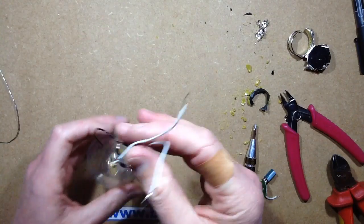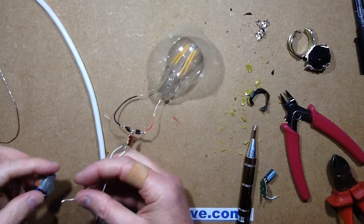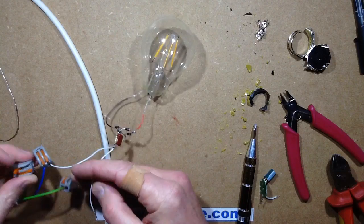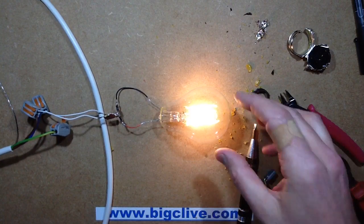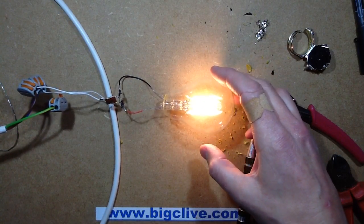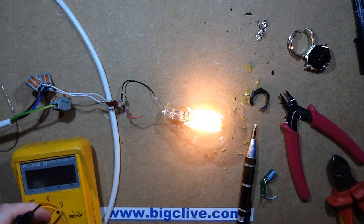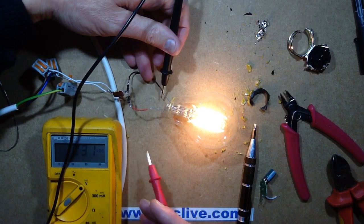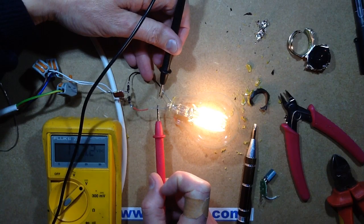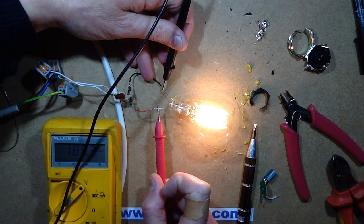Shall we try this? One connection. Do a connection. Yay! Did it flicker initially? It is running the full voltage sort of thing. Let's measure the voltage across that. This will be choppy — it's not smoothed. So DC voltage across that, carefully avoiding touching live bits. One hundred and eighty-nine volts.